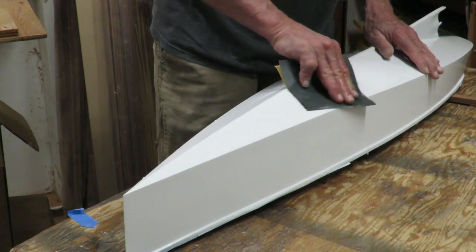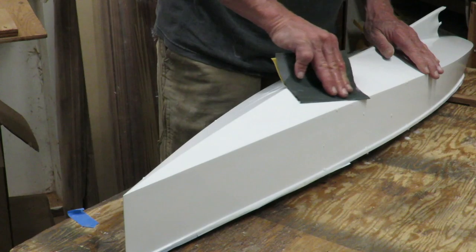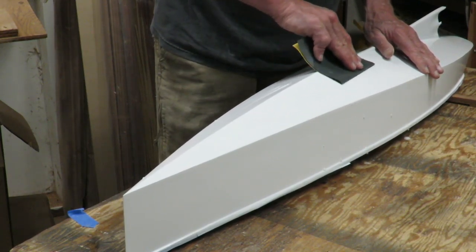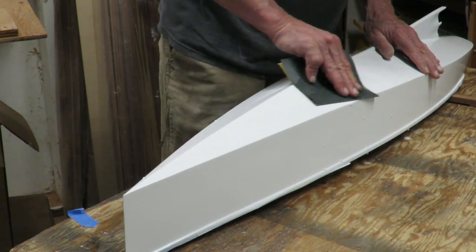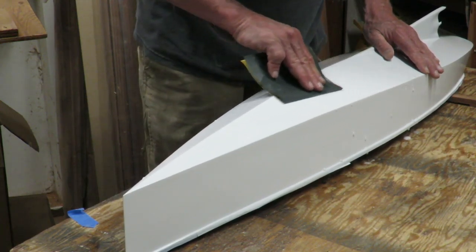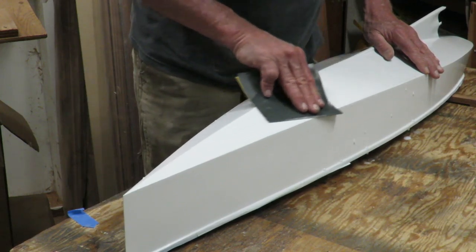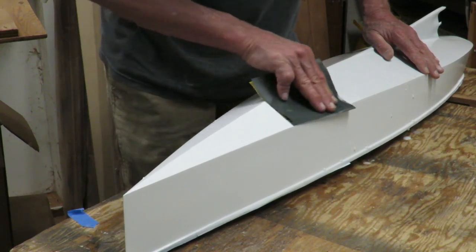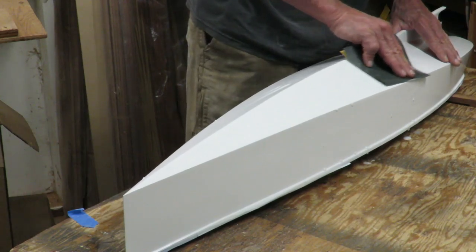If you want a slightly matte finish, you don't buff it. You don't use quite as fine a buffing compound. But if you want a real high gloss finish, you just keep going until it's mirror smooth. So this is probably the best finish that you can get, because in the end it's a buffed finish. It's really hard to avoid having any dust particles, but any dust particles will be sanded out and buffed out.